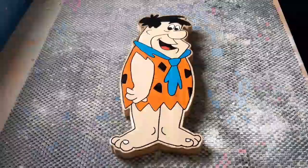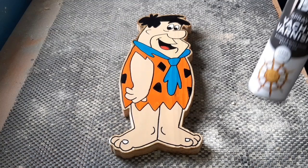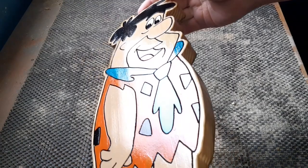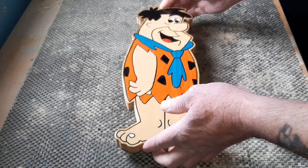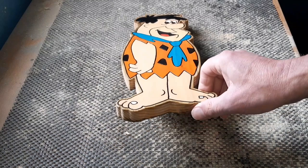All right, that's it — this little project is over. I gave him three or four coats of the 151 yacht varnish. As you can see, that gives it a nice shine and a little bit more protection with it going outside. Like any wood, no matter what you put on it, in years to come it will start changing and altering. I'm hoping to get a good couple of years out of this yacht varnish or the crystal clear I normally use. There are better finishers out there — it's entirely up to you what you're prepared to use. We put the linseed oil down the side just to darken that wood down, then sprayed it with the yacht varnish to finish it off.